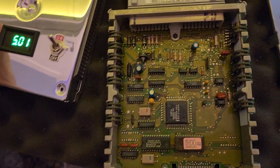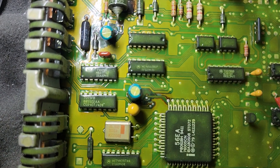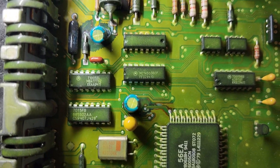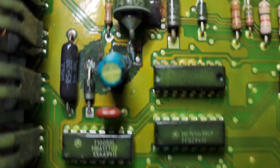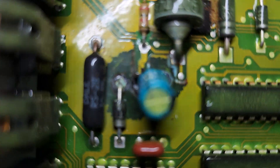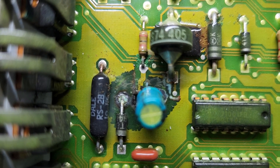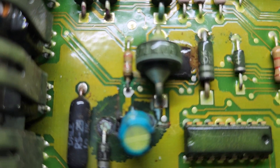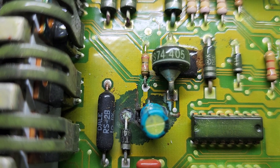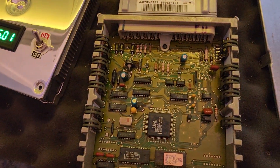But it's definitely got some seriously leaking capacitors, and chances are it's probably going to have a little bit of damage on the board. We're going to have to get rid of the corrosion, get rid of these capacitors, and then inspect and see how bad that damage is. If any of these tiny little traces are damaged we'll have to repair them and reflow some of these solder joints. That one's the one I'm really worried about — see how even the resistors above it have corrosion, green crusties. This one's pretty bad. I bet it probably still works but maybe the car doesn't run quite right — it's a good candidate for a rebuild, hopefully we're not too late.